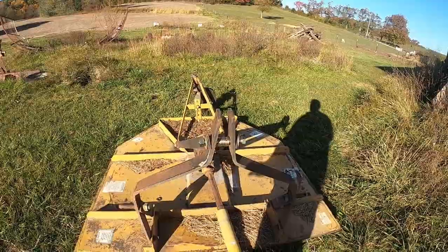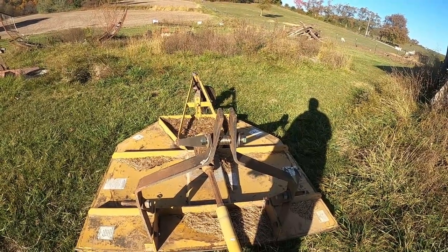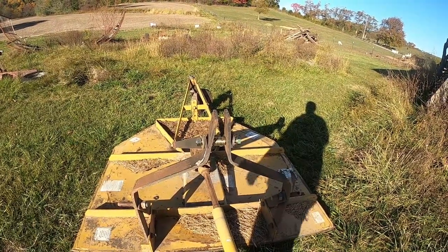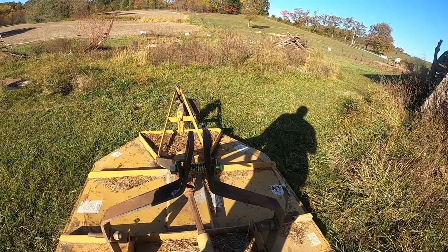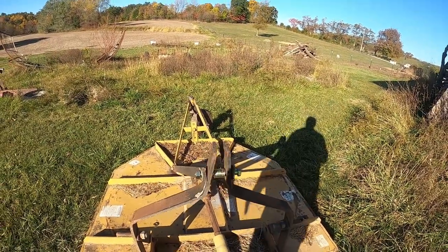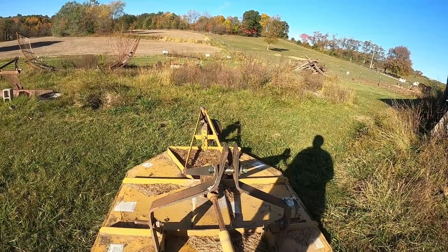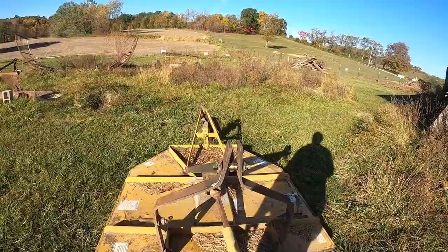But if it falls off, that's a simple way that you can fix it. Like I said, I tried it — first time I tried it, I wasn't thinking about spacers or washers, and this thing would just collapse in, and it just made it a pain in the rear to try to hook up the third arm on the brush hog and had to get kind of like a crowbar and pull it apart every time. So I figured I'd try some washers.